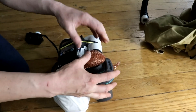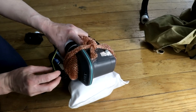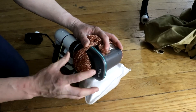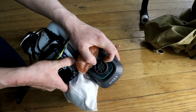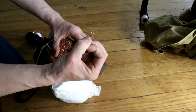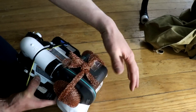Under the bag — I've taken this one off so you can see it better — is some wire mesh, some copper-plated wire mesh. That's just to hold the bag up away from the blower so that the bag doesn't vacuum-seal to it. If I just had this little hole the blower was pulling air through, the vacuum bag would stick to it and only pull air through a spot a couple of square inches in size. But this way it's able to pull from the entire surface.